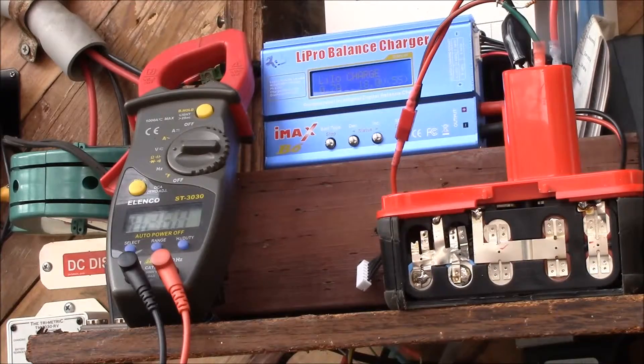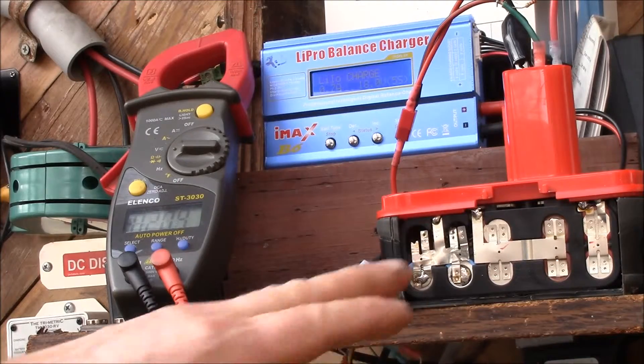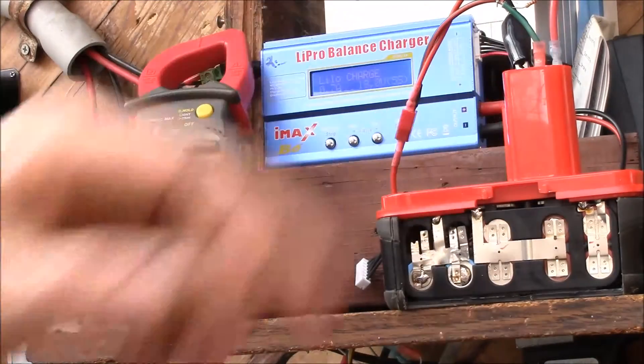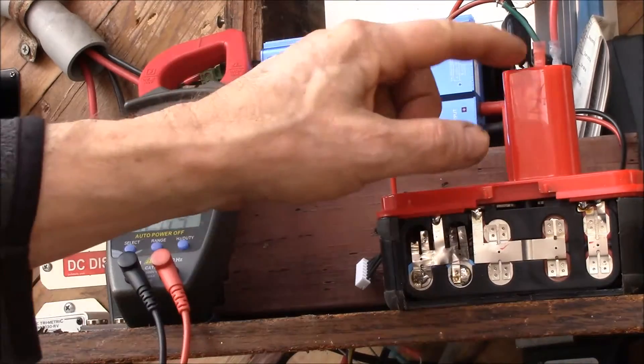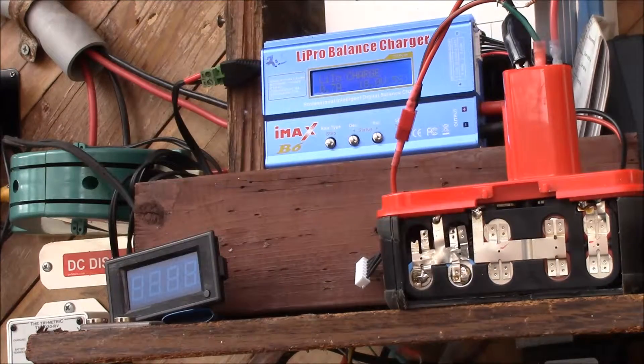That at least confirms my suspicion that this IC doesn't do cell balancing. I think the later packs do some cell balancing and I'll need to check that, but first I want to figure out how to get the charging leads working reliably - I'm still not convinced this pull-up resistor fix is the answer because it doesn't always work. If anybody has experience charging these batteries or has looked into the circuitry, feel free to drop a note in the comments. Check out my other videos, rate, share, and subscribe for updates - thanks for watching.